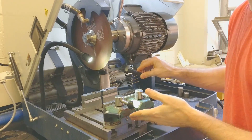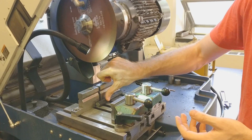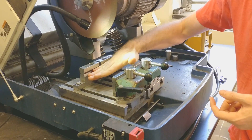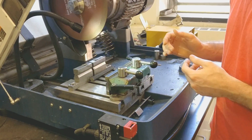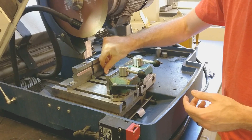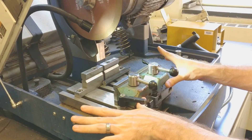The left side clamps better than the right. The blade comes down basically in between these two stops. These stops should be parallel, flat, and backed up a little from the rear so that the center of the blade cuts the piece. So if we want say a half-inch piece, maybe go about this far, and slide these forward.